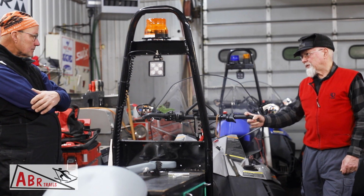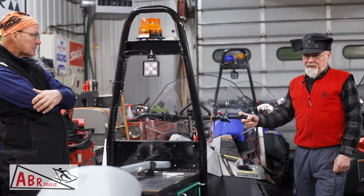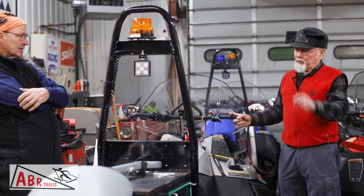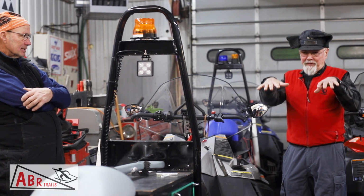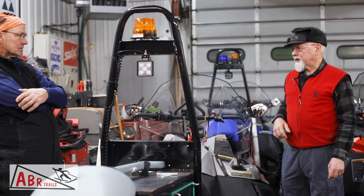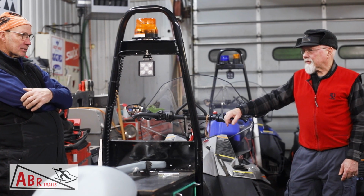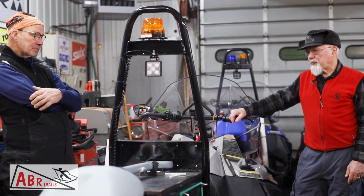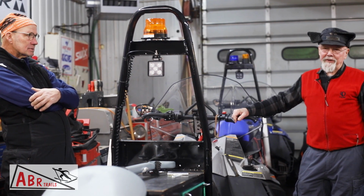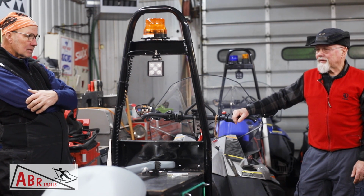And also, along the same lines, even if you're out on a skate lane or whatever, you can put your track pan down. If you're not setting track, you can put that track pan down and that'll help lift the groomer a little bit out of the snow and it'll pull easier. So it might help you get up the hill without getting stopped. So yeah, that's pretty critical. Not a lot of people know that. The track that you put in the skate lane, the skaters will chew it up in 5 minutes anyway, so that doesn't matter.